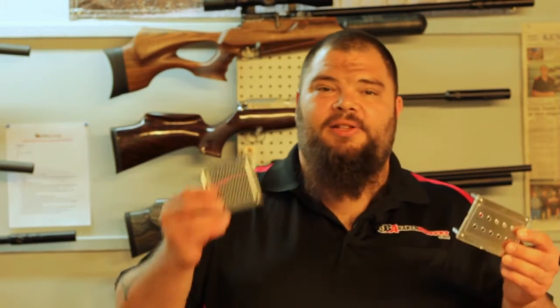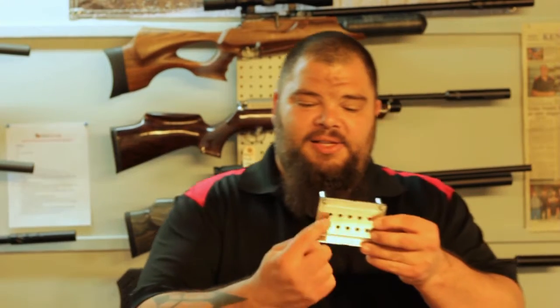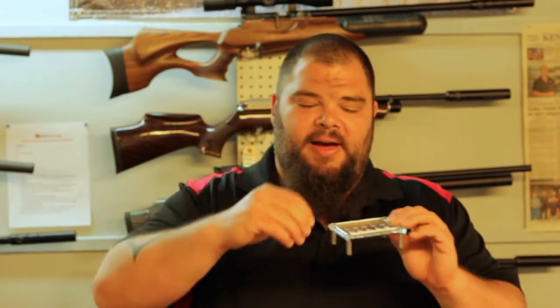This is the latest evolution of the original Pellet Gauge. If you're not familiar with it, it's a device used to sort pellets for head size. To shoot consistently, you have to shoot the most consistent ammunition you can get, so I sort my pellets for competitions. The original Pellet Gauge works as a go/no-go gauge — it has different sizes and you take a pellet one at a time and put it up to the hole; it either goes or doesn't. It's an outstanding tool, but it takes a long time to sort a whole tin of pellets.